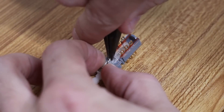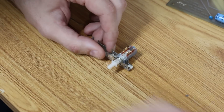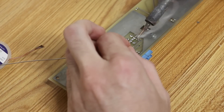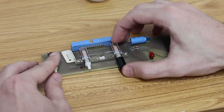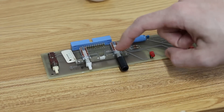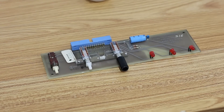The top side still had a bit of solder left so I heated it up with the normal soldering iron and pried up with a little tool, walking the switch right out. Next, remove the little metal tab to convert the switch from a toggle to a momentary, then slip the new switch into the metal mounting bracket and bend the tabs over to hold it in place. Finally, solder the new switches in — good as new. These feel way better than the old ones. Lynn, thank you so much for the care package and these push buttons — they absolutely rescued this part of the build and they're going to live on in Cincinnati.